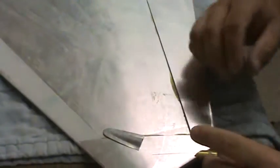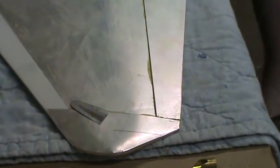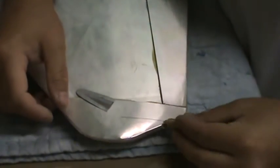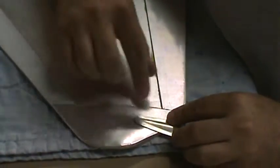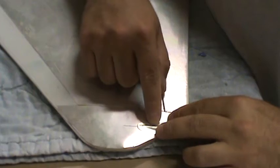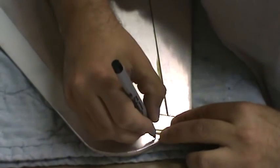First thing I'm going to do is take this little brass piece here — make sure y'all can actually see what I'm doing. Take the brass piece, put it in position. You want this line to run just about down the center of the brass position fixture. Place your little fairing that we made in the previous video in position so the line runs about down the middle of that, then mark its position with a Sharpie marker.